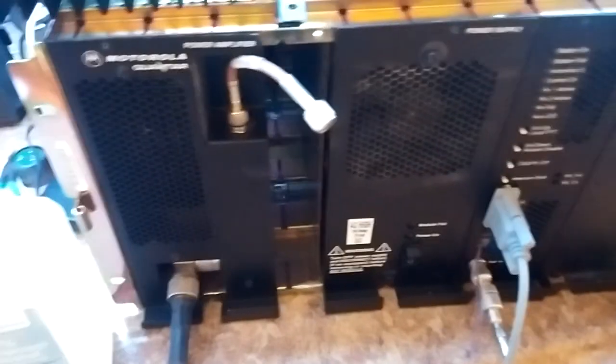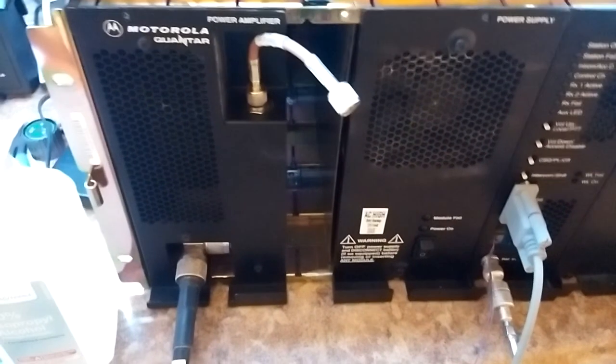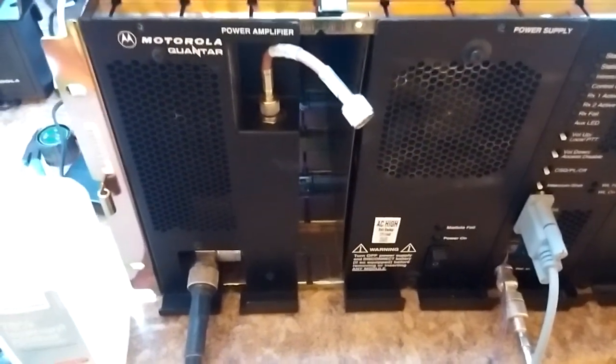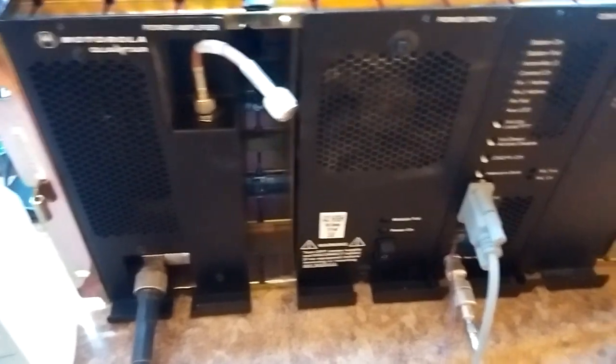The PA is actually very easy to convert — I'm not going to open that up, but it's just a matter of changing the ID bits. It works all the way up to 999 megahertz. There's an extra 2 dB of insertion loss in the final output filter, but that's no big deal.